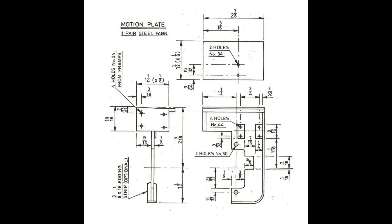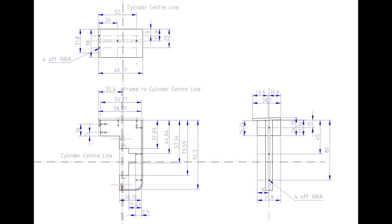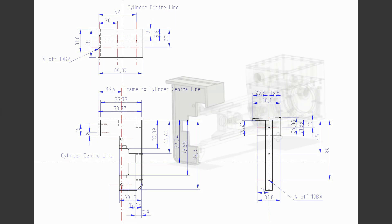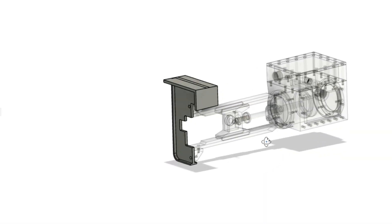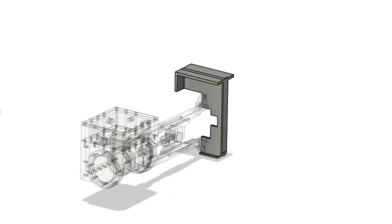Lastly, I need to update the design in accordance with what I've built so far — my conversion from imperial to metric and those little changes that all start to add up. I should also add that there are a couple of errors on this part of the drawing, but I've dealt with those in my conversion. So armed with a calculator, a spreadsheet, and LibreCAD, I've updated Don's design as I'm showing on screen now. I've also been leaning heavily on Fusion 360 to help me visualize these parts coming together.